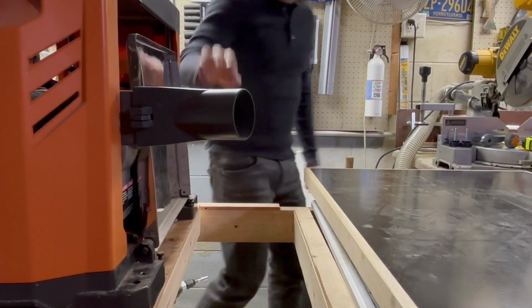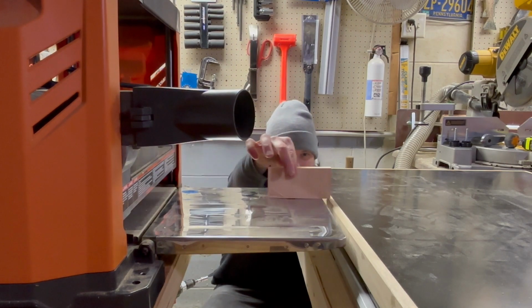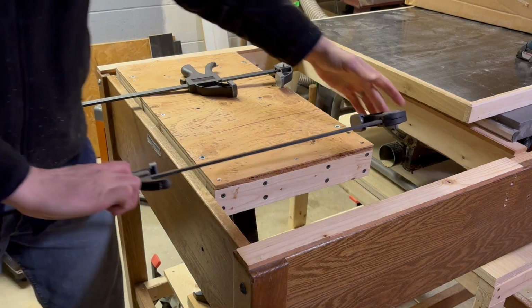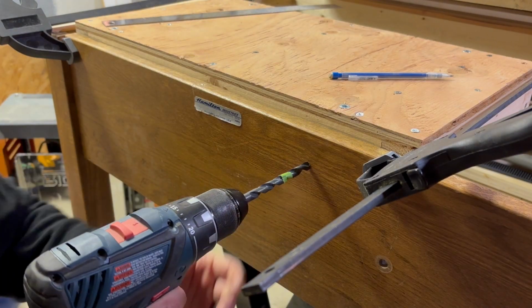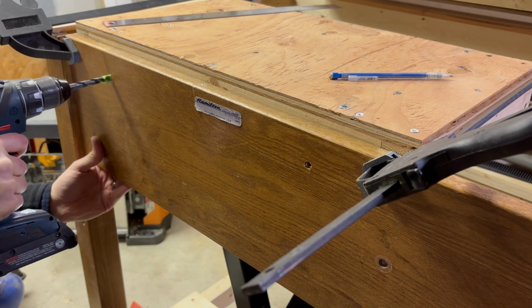And then I put the lift all the way up into planer position, and I opened the outfeed from the planer so I could make sure it was in perfect alignment with my new outfeed table. And then I clamped it against the frame of the bench so I could install threaded inserts and really lock it into place, eliminating any wiggle when I'm using the planer.